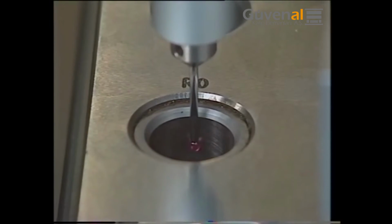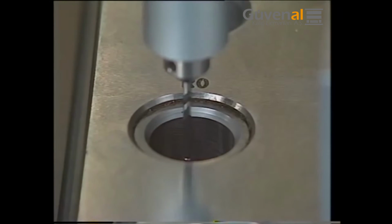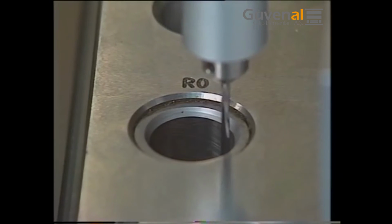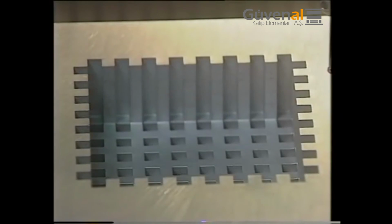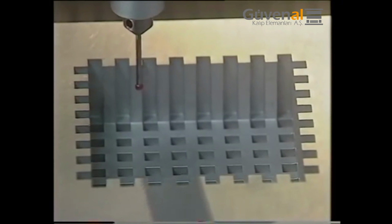Electrodes and workpieces are measured simply, rapidly and reliably. Machining can be interrupted to check the measurements of workpieces, which are mounted on Refix pallets. Refix CMM supersedes other forms of presetting, as electrodes as well as workpieces are measured by 3D technique. The Refix CMM also fulfills the conditions for 1-minute setup.